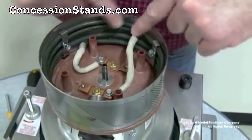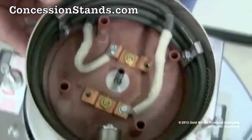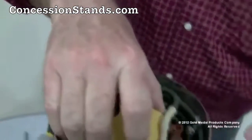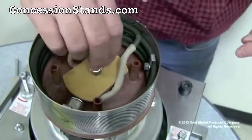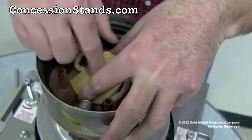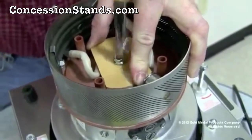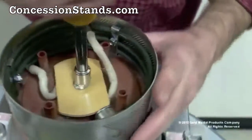Please note a quarter of an inch clearance between the heat element and the plastic screw standoffs. Install the plastic terminal guard — there is a top and a bottom side. The bottom side of this terminal guard has two recesses. Reinstall the jack screw and the metal serrated flange nut. Position the terminal guard such that the copper terminals are fully covered to prevent accidental contact during use.